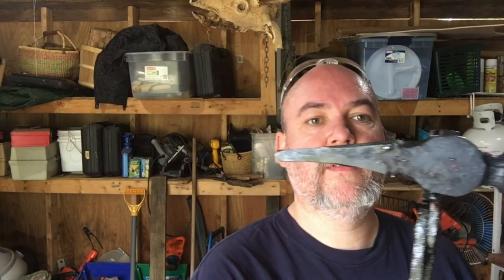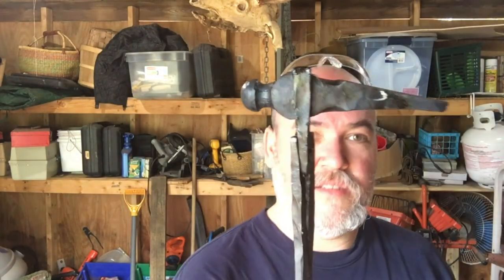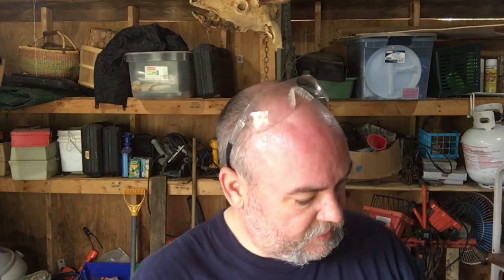All right, so here we are. This is where I've got it to. I still got to grind it. Still a little warm. I think I've done this right. So I need to clean it up, and then I've got to bring it up to temperature and quench it and make sure she hardens. But the beauty is I did not deform the eye, so I'm gonna be able to reuse the hammer, and I don't have to drift this, which is a good thing because I haven't made my drift yet.